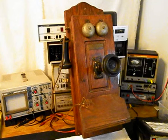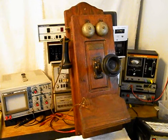It has the original diaphragm style receiver capsule, and if we can get enough audio from that receiver capsule, we'll go ahead and utilize it in our conversion. If not, we will need to upgrade the inside of the receiver capsule. We also want to troubleshoot the cloth cord. If it turns out to be good, we'll try to utilize that in the conversion also.